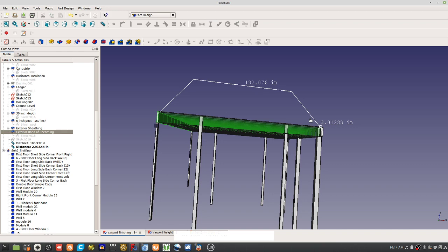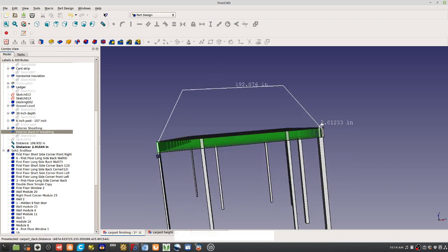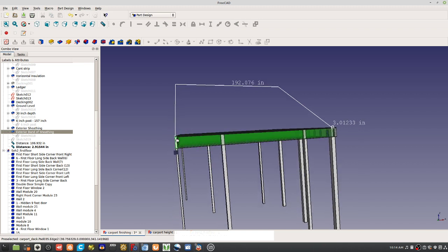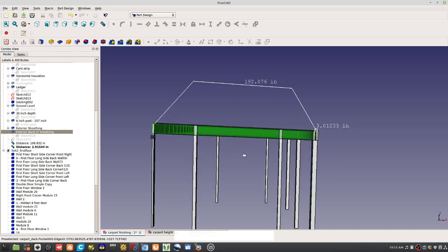Probably if we shoot a laser beam at the top here, then you can measure the 4 inches from a laser. We've got the lasers that do the two cross beams. So after we have, say, the beam here already, just put the laser right on top of the beam and measure the distance from the beam, like on this bottom edge here, make sure it's 4 inches lower, just measuring with a tape. That's one way to do it. Or just a standard level.